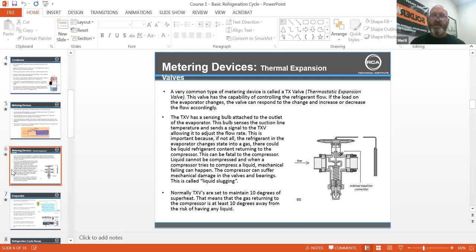Jim is 100% correct. I used to do a lot of work at military bases like Fort Irwin and 29 Palms. They put in Maneurop compressors with built-in accumulators, and we were running one to zero degrees of superheat to keep those compressors cool at 120-degree ambient. Really know your system — know the design ranges, what the TXVs are set for, and do not get stuck on that 10 degrees of superheat.